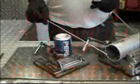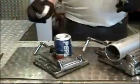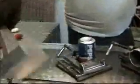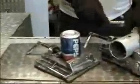Use this rod to weld or repair aluminum. You can weld aluminum as thin as this, or you can repair or weld really heavy material. It takes the same 730 degrees for every job, no flux required. Basically two steps: you clean the base material with a stainless steel wire brush.